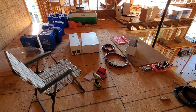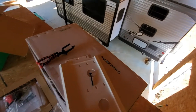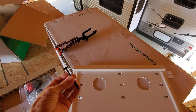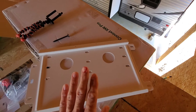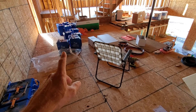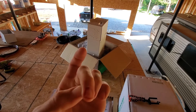I'm going to try to get these mounted up and work on the wiring probably over the next couple of days. I haven't found any videos online on how to connect everything, so I'm going to brainstorm it. Here's the hanging bracket for the inverter. These are the screws I'm going to use — these are structural screws, two and seven eighths inches — they'll fit through just like that, one, two, three, and four holes. This inverter says 150 pounds but it is way heavier. These batteries are 125 pounds and I can pick those up no problem, so that inverter is a beast.